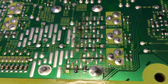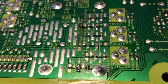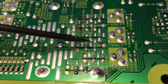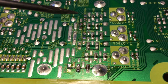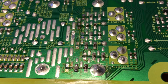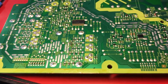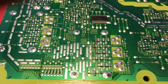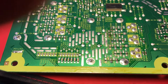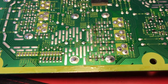Although it's not a constant DC circuit, as I said before, it's modulated by PWM, it still makes a big difference if you just remove those resistors, because the resistance here will be like twice as much as the original. For example, 2.5 ohms as opposed to 1.8 ohms. That makes, say, 50 milliamps or less of current flowing through the LEDs. That circuit is pretty similar to the average circuits in LG, Samsung or Vestel TVs as well. Those circuits are all similar. You can safely do them. I tested that it's safe today.